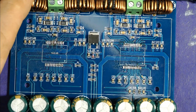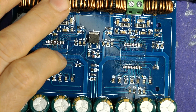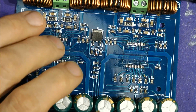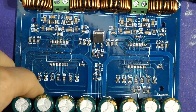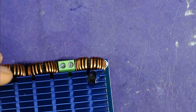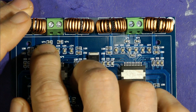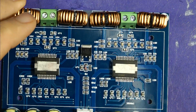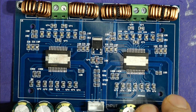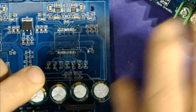You have to use 8-ohm speakers — you could use 4-ohm but you wouldn't get peak power and it wouldn't be good, with higher currents flowing. This board isn't really tracked up for it: at 300 watts or even 220 watts you'd be talking about 6 or 7 amps RMS going through this device, and the power tracks are fairly thin. I think 80 watts would be comfortable. Change those two caps for decent ones. On the other cheaper module even smaller caps are fitted — terrible — so you've got to put decent polyester caps in all three positions, drill holes, bring the wires through, and solder them on the pads.